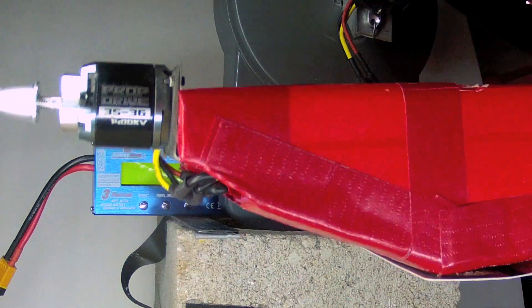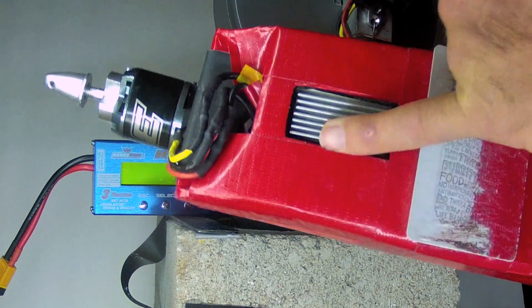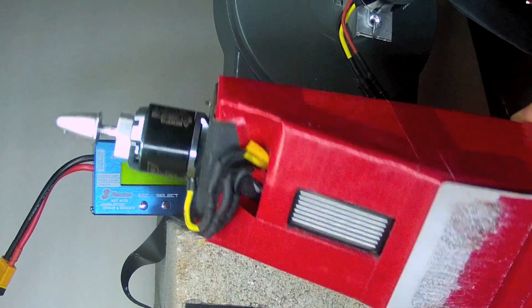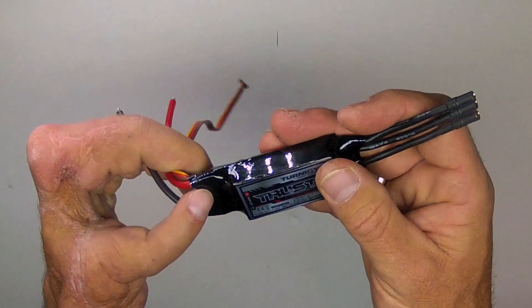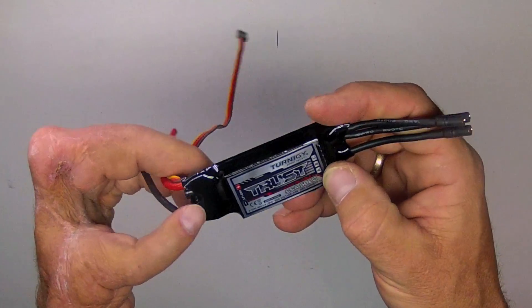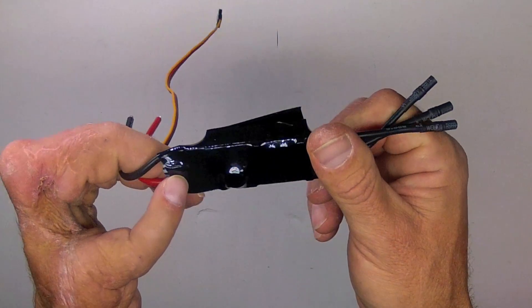Here's an example of that with the Synapse, where I've actually mounted it on the bottom, with the fins protruding up to flush with the outer surface of the aircraft, but protected from debris on landings. This does have a 3-amp switching BEC — that's a fairly generous battery eliminator circuit, and will power probably up to 5 average servos and your receiver.